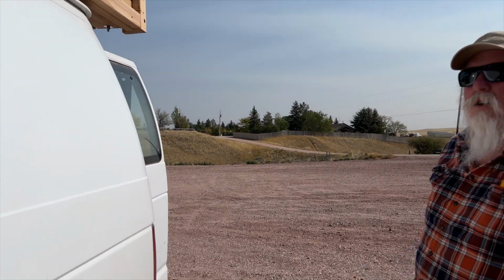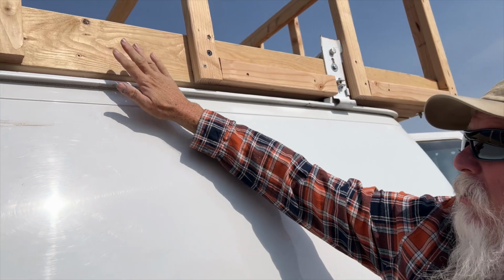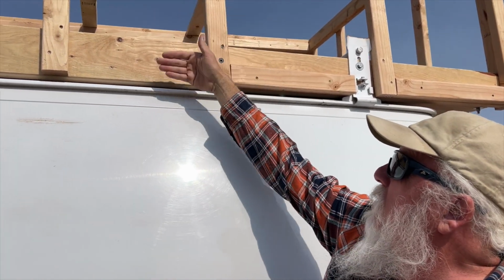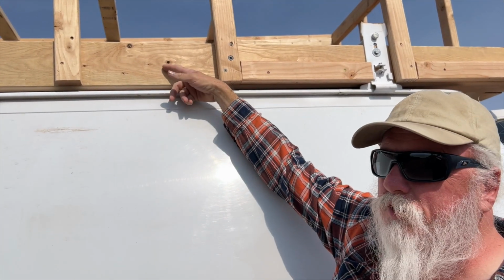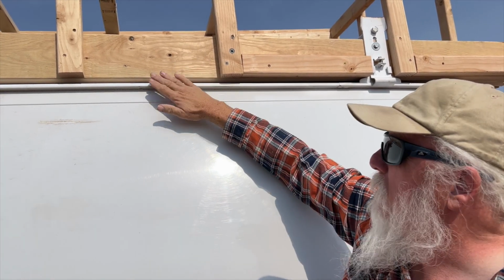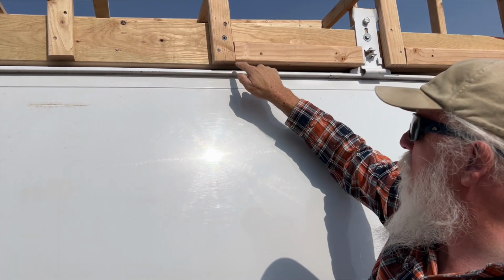There we go. I mentioned this in a previous video, but because we put the wall framing on the outside of this rim board, we have a gap here. So we're going to put insulation here, but we don't want wind, moisture, insects, whatever else coming in there. It seems to me like that'd be a perfect bat cave. We don't want them coming in either. So we're blocking it off to prevent that, and we'll seal it around the edges here.